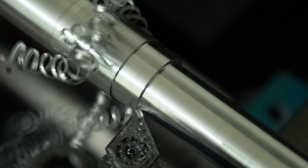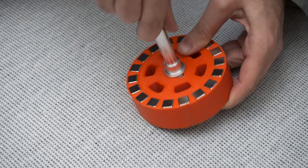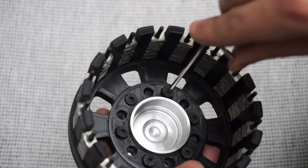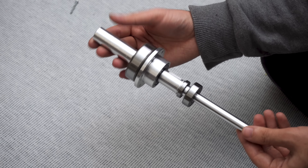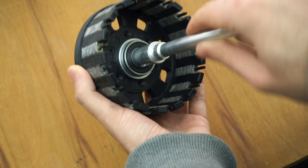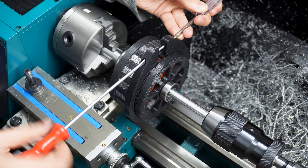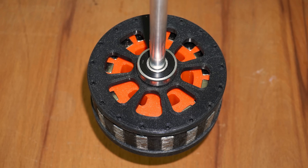After the gears were done I made the shafts from aluminum, as it is lightweight and easy to machine, allowing the rotors to run almost touching each other. I secured the sun gear to the shaft through a keyway, which can withstand high torques and makes it easy to remove and install. The modulator shaft is made of thicker aluminum as it will rotate with 5.67 times higher torque than the sun gear, and instead of a keyway it was secured to the hub with six bolts. Since I couldn't support the shafts from both ends, I simply nested them inside each other.